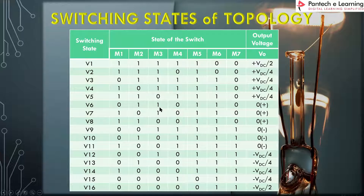Here is the switching pattern — the switching states. To get VDC/2, which is half the maximum voltage, we switch on M1, M2, M3, M4, and M5. Correspondingly, M8, M9, M10, M11, and M12 are driven with inverted pulses — if M1 is 1, then M8 is 0. In this way, pulses are generated for VDC/2. Similarly, there are 4 switching stages — V2, V3, V4, and V5 — generating 5-level output patterns fed to the MOSFETs.